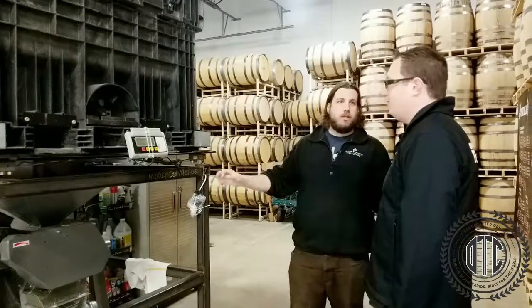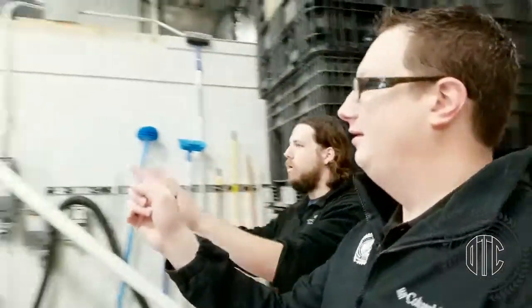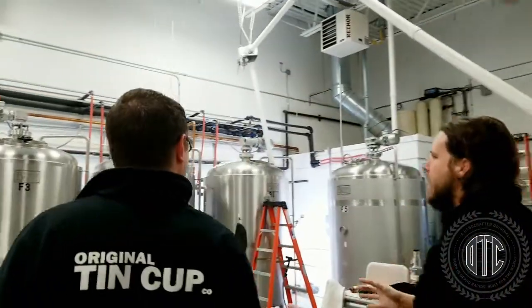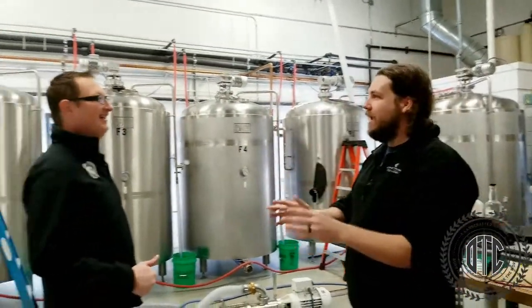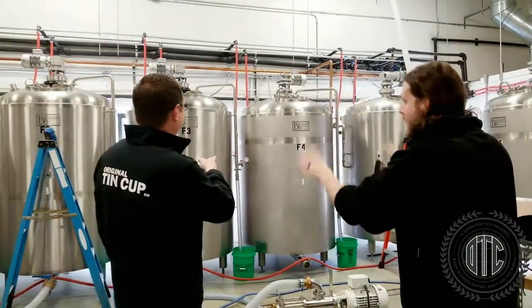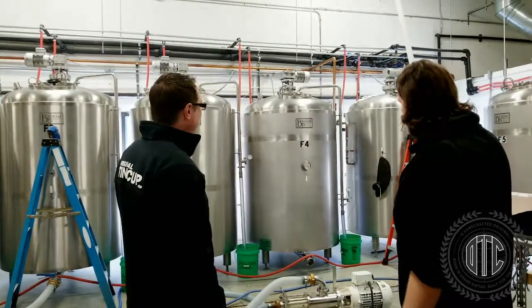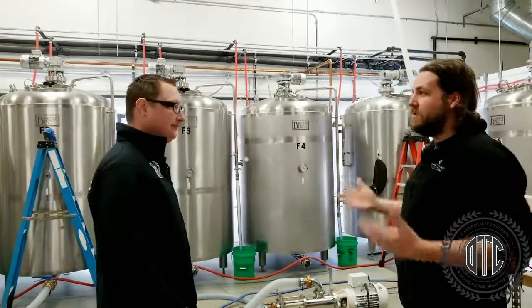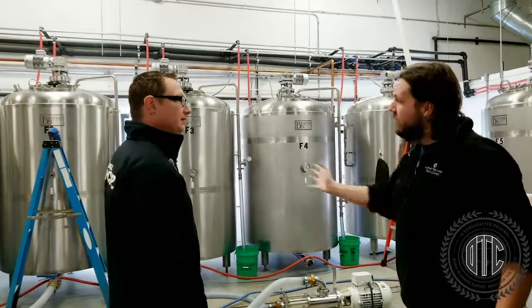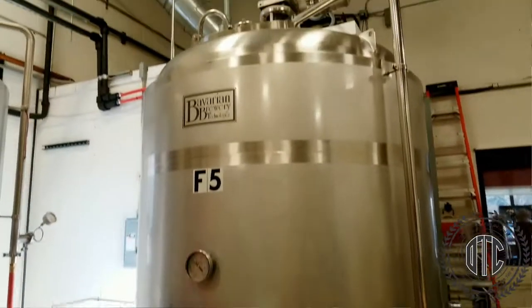This is what turns the raw grain into grist, which kind of looks like oatmeal and flour. If we look this way, this is where the heart of the alcohol creation comes from. People come back here, see the stills, and say this is where you make your alcohol — well, nope, that's where we sort it. Everything is made through fermentation here. 1,200 pounds of grain, 400 gallons of water. You want an enzyme reaction to turn your starches into sugars. You then move that sugar mash into fermentation. One mash tun, five fermenters.